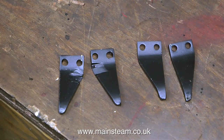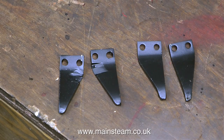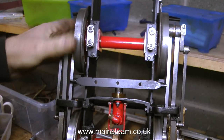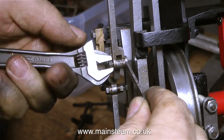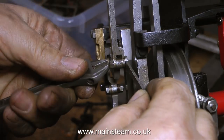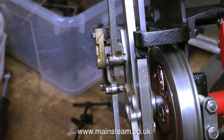These are the guard irons that fit at the back and front of the locomotive, used to deflect anything from the rails that could derail the engine. When I first saw these I thought there was damage, but it isn't damage done in service — it was done by somebody grinding away part of the guard irons to fit them in the right place. I'm having a quick check to see if anything's fouling — the brake hangers are in the right place. Where the eccentric rod mounts onto the expansion link, the nut is very close to the crosshead, so the solution was to turn it round and machine the head of the pin a little bit thinner so everything clears.